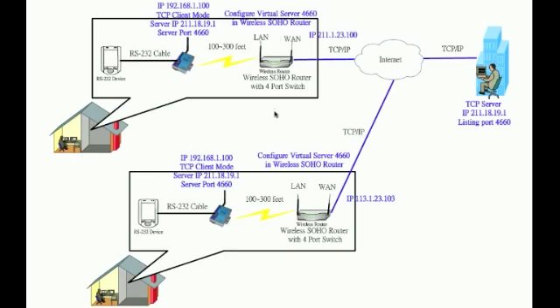Let's say you're an installer and you install 20 to 50 systems every month, and you want to offer a system to your customers and to financial institutions and government agencies for these government programs being developed every month. Here's a service and a way to do this. You can offer the service by sending the information that's already at the router — you can assign another IP address at that router, send it out to the internet, and send it to one location. This example shows two locations going to one port, or one server, with all the data going into a database. You've set up a TCP server using the listening ports for your locations, and it's all in one point.